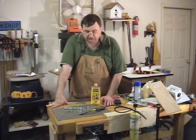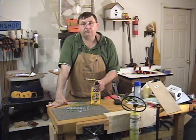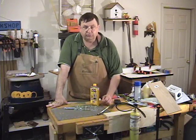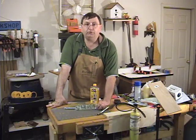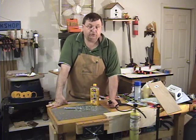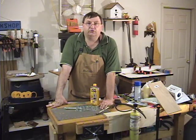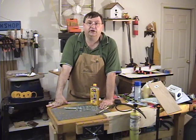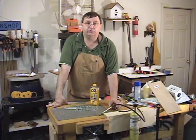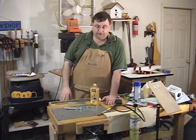The last thing you're going to need — and this is what makes this project a little different — is we're going to use a blow torch to actually smooth out the acrylic after we finish cutting. When we finish the cut right off the saw, the blade leaves a frosted look on all the edges. If you want to smooth that out, the fastest and easiest way is to use the blow torch. Make sure you do this in a well-ventilated area — you will probably catch the acrylic on fire just slightly. Use caution with any open flame.